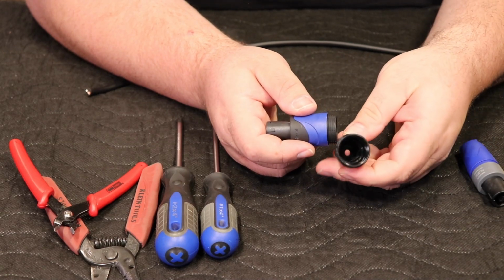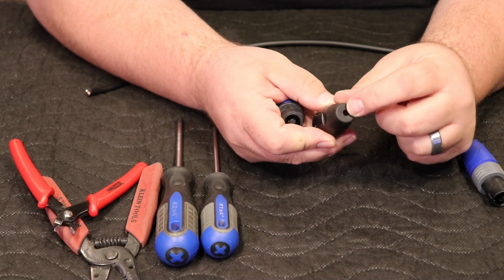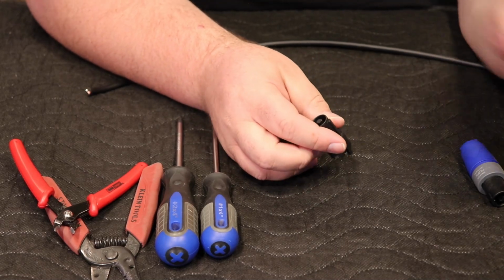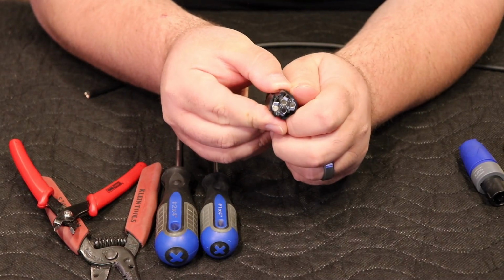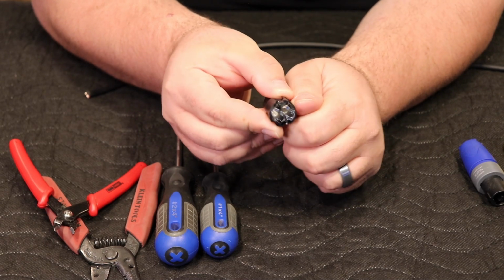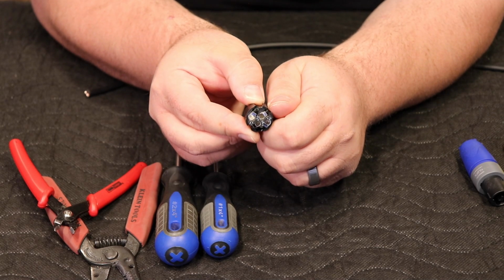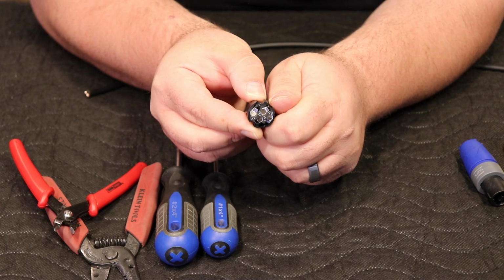Even the sleeve or whatever may take a larger cable that's all rubberized, so it'll take a big cable. All right, let's take this guy apart. So on the inside, you'll see that there are 4 small spots there where the cables can go in, and there are little set screws that tighten down to hold the cables in the connector. And on this one, you can actually see, because thankfully Amphenol have printed the conductor numbers next to each slot. So there's -1, +1, +2, -2 across the connector.